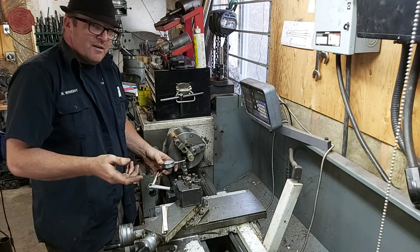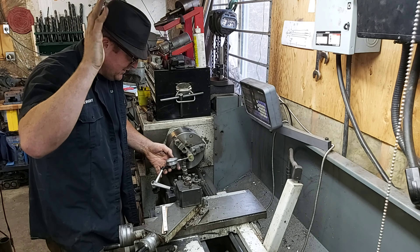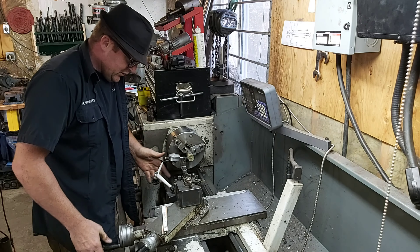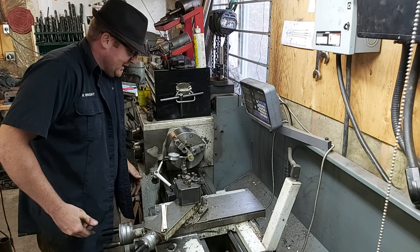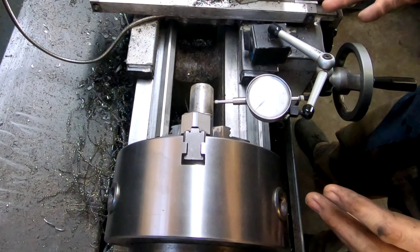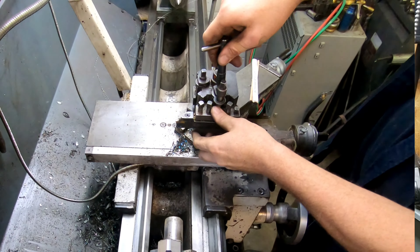In one of my other videos, I got in a bit of heck from a tool and die maker — and in my personal opinion, tool and die makers are way above the skill level of machinists because they deal in such high precision. He told me that in my boring video, which he's absolutely right, I didn't show dialing in the inside of the bore, and I really apologize for that. So I'll just catch it in this video — it's just a handle, but I'm showing it so you know it's the basics that you need to do. We're within 5 thou, so not a big deal.